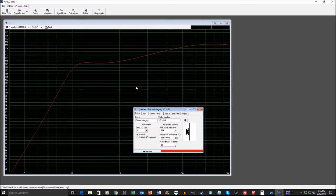So you may ask, why does a subwoofer have to be so big? Well, this design that I used is called a large low tune design. Basically, you make a really large box with a lot of volume and you put a big driver in it and you get a low tuning frequency, in this case 11 hertz. Why would you want an 11 hertz tuning frequency? Well, there's a lot of movies that do have content down to that level. Unfortunately, most of us don't really get to experience it, but if you do have a subwoofer that can help you experience that, then it's a very memorable experience to be had, because not only will you get all the bass of the movie, but you're going to get room-shaking bass that you can feel.